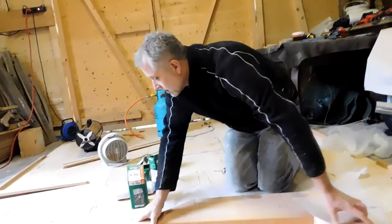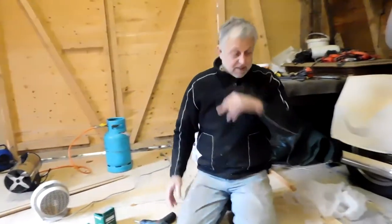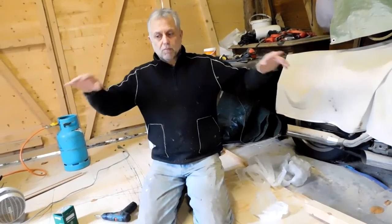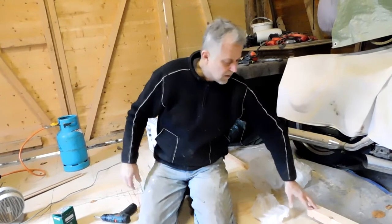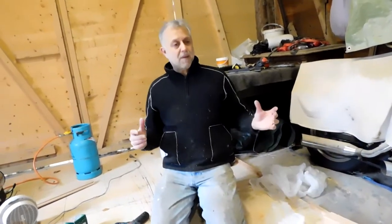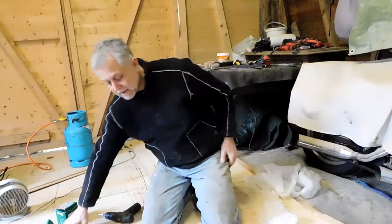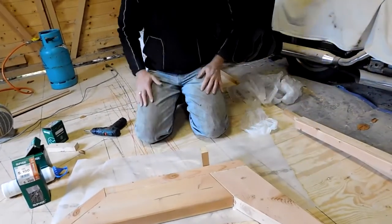Just make sure that's lined up on the lofting lines. Now, my deck beam which I laminated over the form — it sprung a little bit when I took it off the form, so I want to bend it back into shape here. Part of the problem is I've cut my form so that it's very thin at the ends, which means the form itself bends up when I clamp it. Also you get a bit of spring because I'm only laminating three pieces. So they spring a bit — the form itself springs — that gives me about a centimetre of spring each end. I want to try and bend it back in. I've got the line drawn on here, and I think I can bend it back into shape as I glue it up. So I'm going to put a block on here, just temporary, so that I can put a clamp over there, both sides, to clamp that down.